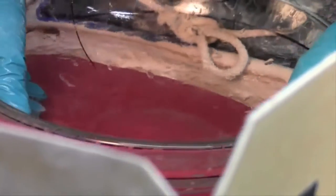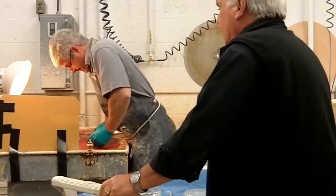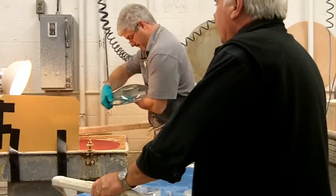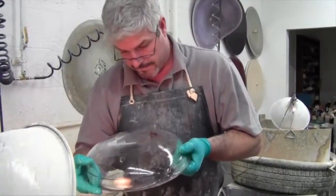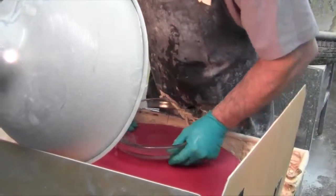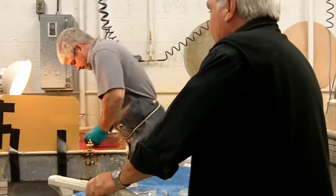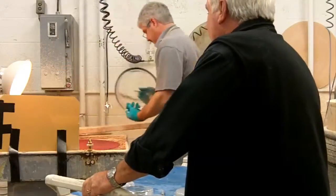Every glass body is different chemically, and obviously the softness or hardness is reflected in that. This is a very good soda-lime glass — it's very clear and quite hard. I definitely let the younger people check these surfaces, because even with readers I'll say 'oh wow, it looks great,' and under another kind of examination there's a myriad of fine scratches. So I let the young eyes do the inspecting and know when it has to go back on the pad.